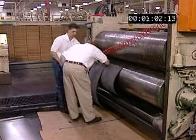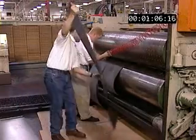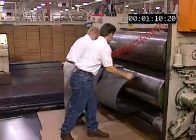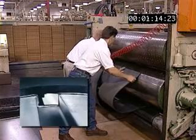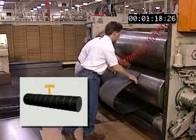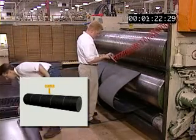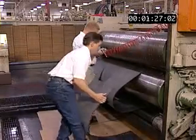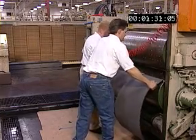The dual-width blanket design is a CUE exclusive. Dual-width Time-savers are twice as wide as standard blankets. They feature all of the exclusive Time-saver design features, including the solid steel lock bar. Dual-width Time-savers promote even cleaner die cutting by eliminating half of the seams across the cylinder. They also allow for the fastest installation and rotation. No die cutter modifications are needed to use dual-width Time-savers.